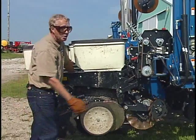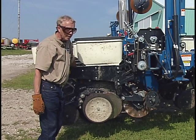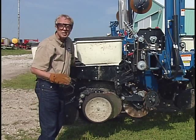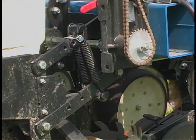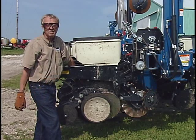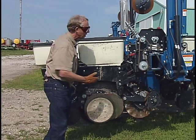One last thing: we want to make sure the depth wheels are in good firm contact with the soil, but don't overdo it. Drier, undisturbed no-till soils are where we tend to see penetration problems, but if the soil is wet or moist — where you're borderline on whether you should even be planting — it's typically much easier for that double disc seed opener to penetrate and you won't need nearly as much force. If you leave those down pressure springs fully tensioned in wet conditions, you're adding a lot of contact pressure and compacting the soil, which is not good for early seedling growth. So use just enough down pressure for contact, but not too much. For example, if you've been planting in dry conditions and get rained out, when you return you'll need to lighten up that pressure to avoid over-compacting the soil.